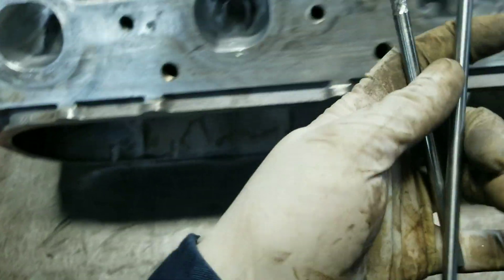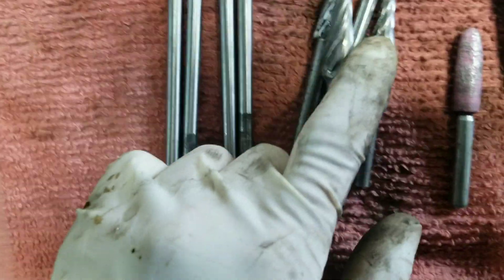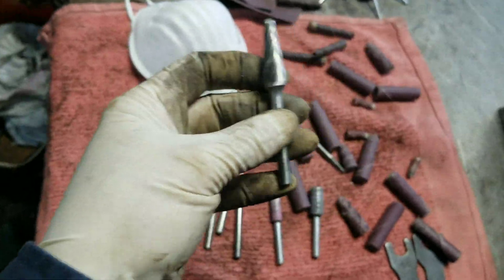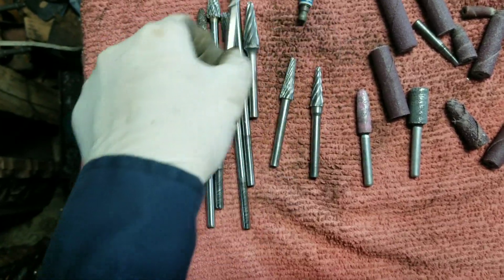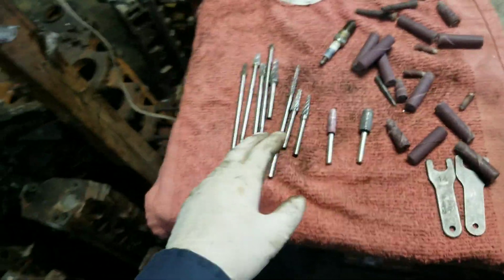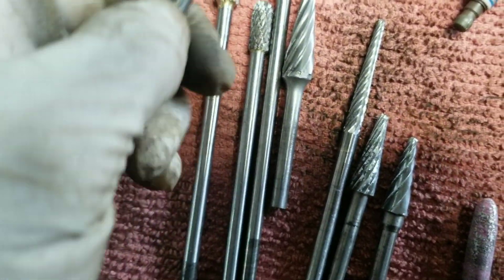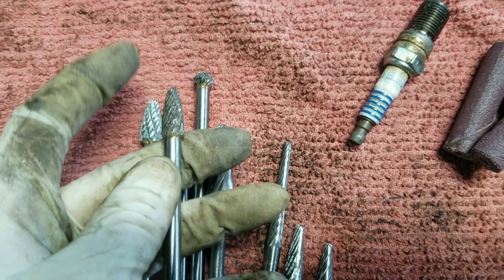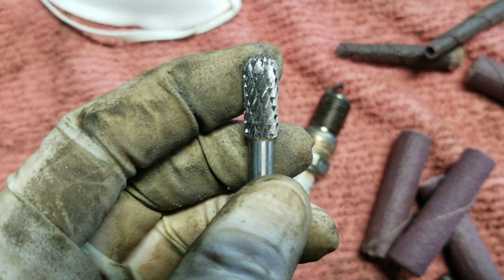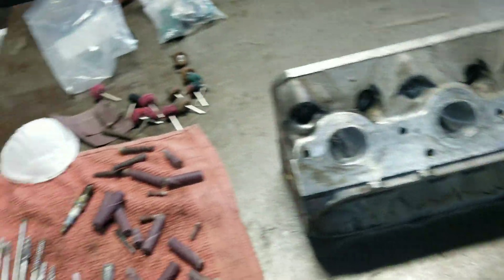Check the difference between these ones and these ones right here. The aluminum burrs — or aluminum bits — are different. You see how the flutes are open? These are aluminum and the other ones are for metal. Here's the trick and tip nobody's going to give you: you can use the metal ones on aluminum. All you have to do is put some grease on it — all-purpose grease, whatever you have. Put it on the end and it's going to prevent it from getting clogged. This aluminum one got kind of clogged because I didn't use any grease on it. So use grease, put it on the tip, and you can work on aluminum. You're good to go.